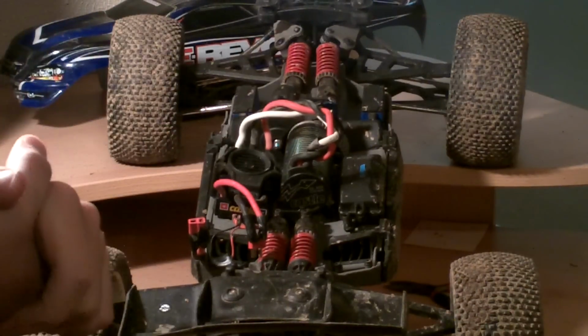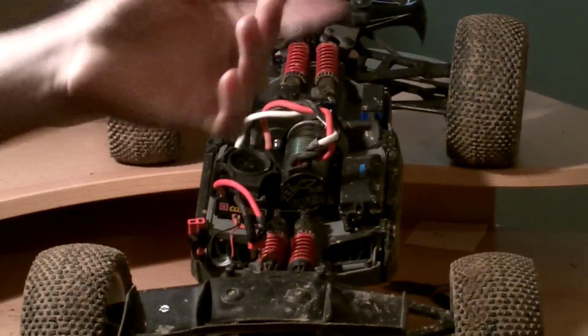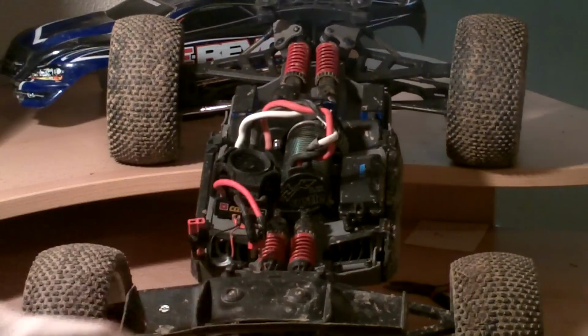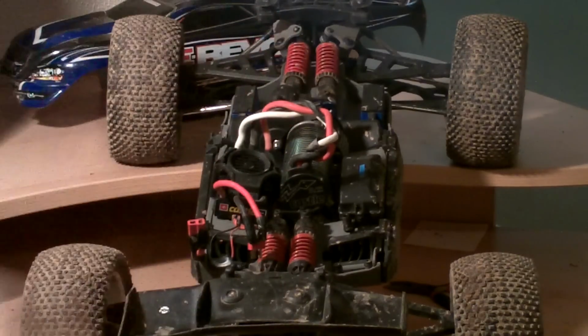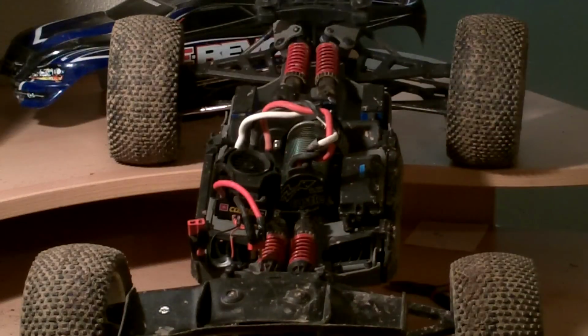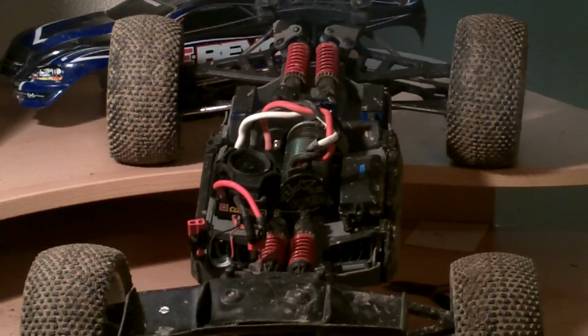As far as spur gears, I've noticed that occasionally some dirt will slip down in there, like small things, say, a sliver of wood. I've had a sliver of wood get down in there, and it got lodged in the gear, and every time it went over, it wore down the teeth, and eventually I stripped the spur gear.